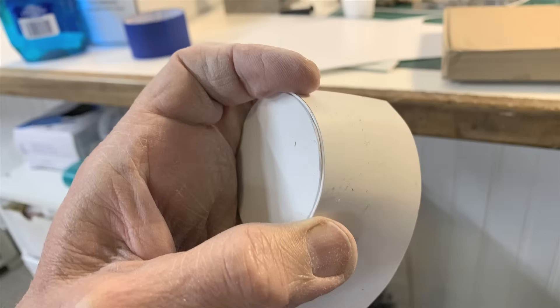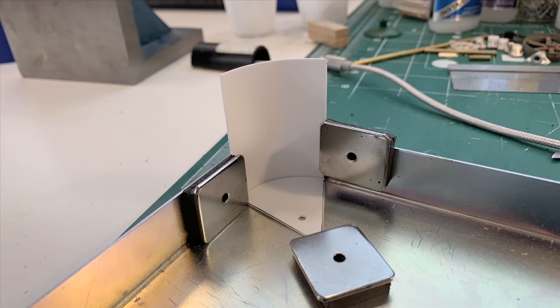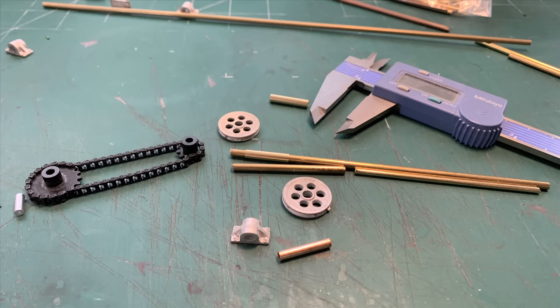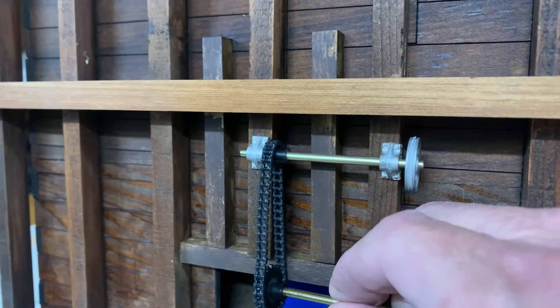Last week we looked at constructing the coal door out of sheet plastic on a jig from Micro-Mark, then cutting away parts of the coaling tower floor. The coal chute and coal door have to function together with nothing binding. Everything is being constructed out of brass tubes and rods, along with castings made in the shop, and a plastic roller chain — also called ladder chain — found on Micro-Mark. It's no longer available there, but a link to another source was put in last week's description.